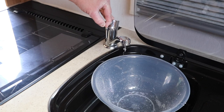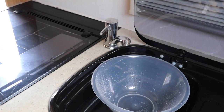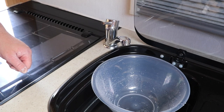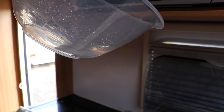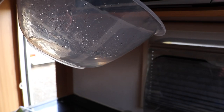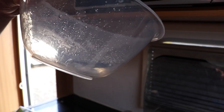The actual instructions are quite clear — they state to repeat the process until there's no more water being blown out of the taps, and that's exactly what I'm doing here. I'm running the air through first time and then running it through a second and maybe a third time as well. That's how much water I've taken out from just one tap doing the cold water. I haven't started the hot water yet and I haven't removed any water out of the bathroom, so let me run around and do those in exactly the same process.